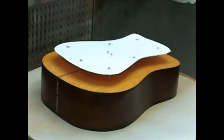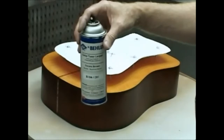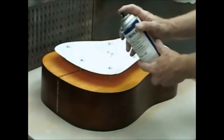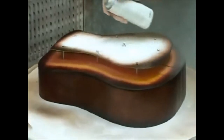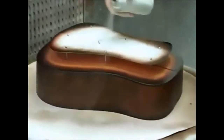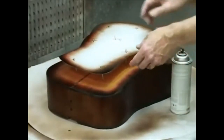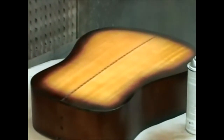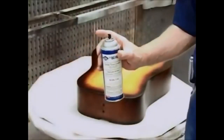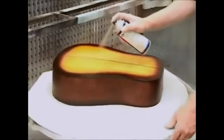Since the cardboard is not directly on the surface, the line made by the toner will be a gradual change of color. We're going to use Encore Brown Toner, the same one used on the sides and neck. Aim the spray outward over the edge of the cardboard until you've added as much color as you desire — the can is about 8 to 10 inches from the guitar. For a lighter sunburst, keep the can at about 16 inches and add color slowly. After the dark edge is complete, remove the cardboard. For another effect, StarCast Amber can be sprayed over the dark edge and in toward the center by about two inches — spraying it heavily will give the sunburst a reddish edge.